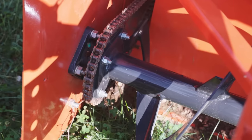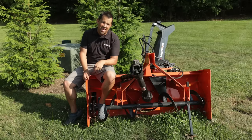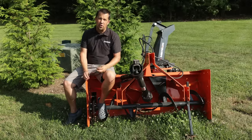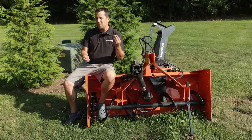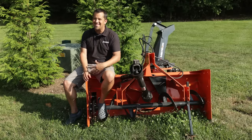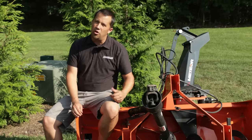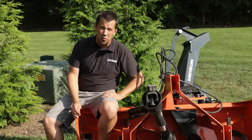The chain on the snowblower has held up really well, but I actually maintain and care for this chain periodically in the off-season. I take a dry chain lube and spray these chains down periodically to keep a protective film on top of them. That chain lube is made not to be washed off by simple rain or a little bit of water, and it's protecting these chains and gears from rusting. A little bit of preventative maintenance every couple of months — I wander over to the snowblower and spray these components down as well to protect them from corrosion.